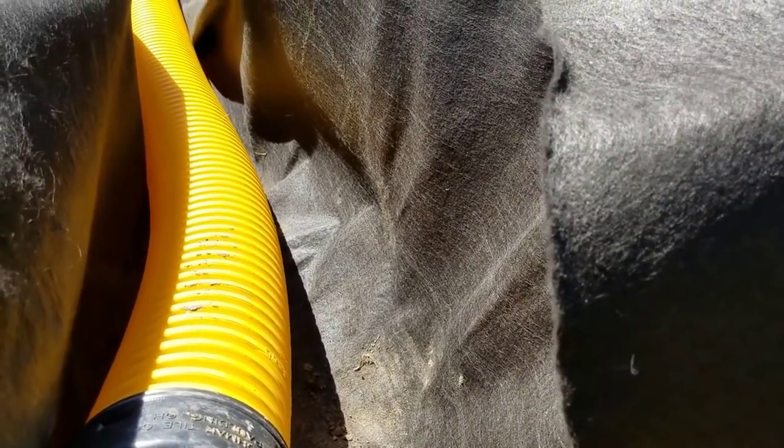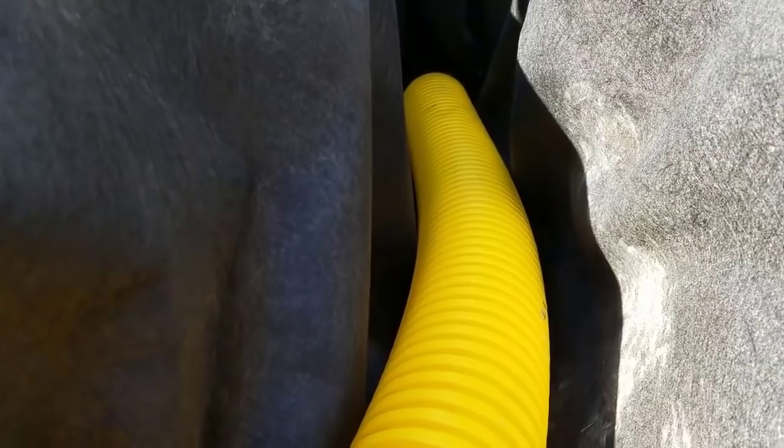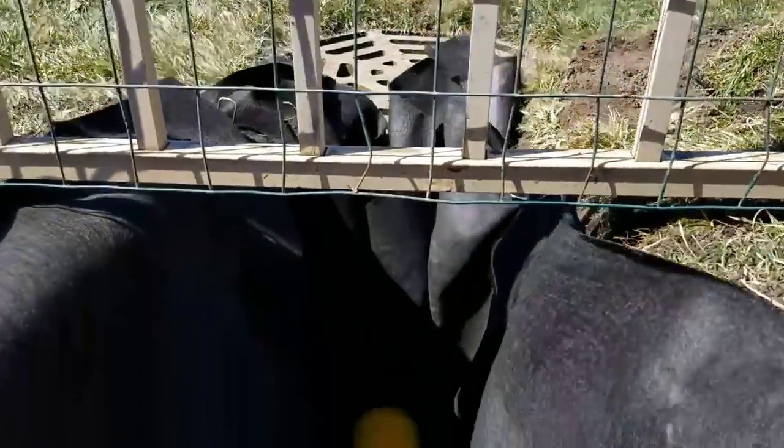Why do I prefer to have it on the bottom? I have the non-woven geotextile fabric, so it's not going to clog the pipe with clay — NDS engineers will tell you that. I want this trench to empty out completely. When other guys put a few inches of stone under the pipe going through the sidewall of a storm drain, what happens is you leave a bunch of water in the bottom of the trench — you're not emptying it out. If you empty out the trench, through capillary action you're going to pull water from the clay, which helps dry out that problem area in your yard.